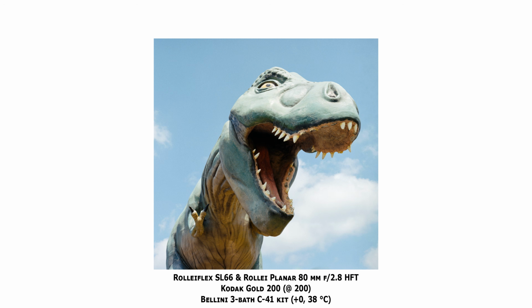The overall job is basically the same as any kind of a rangefinder, especially a Barnack camera, but yeah, there are of course a couple of small things, nitty-gritty details specific to the SL66, because there always are. Mainly the fact that it's not easy to get to the front side of the curtains from inside the throat of the body, just because it's such a deep, long camera.